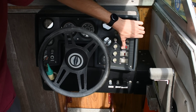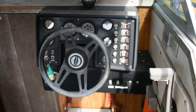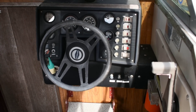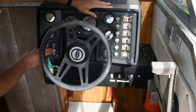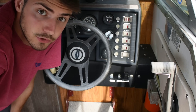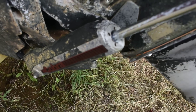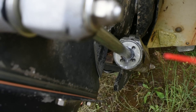Let's head up to the helm and test some systems. Let's see if my gauges turn on — battery switch. Alright, take two. Hey, look at that! We've got fuel, RPM tach zeroed, oil pressure moves, water temp doesn't move, we're getting a voltage reading, got trim. Let's turn on the blower — blower kicked on. Bilge pump kicked on. Windshield wiper — hey, look at that, windshield wiper works! Horn does not work at all. Let's see if the trim works.